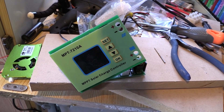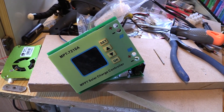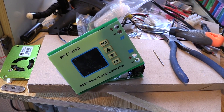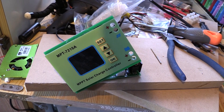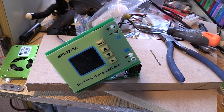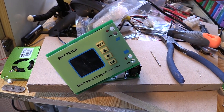I was really hoping to have this third unit pretty much from the factory, plugged in and connected to compare it to the other two. However, with this one just blowing straight away — it blew because I had the two 250 watt panels plugged into it. So the voltage is slightly higher than the other ones, and because of that it must have just blown the cap.